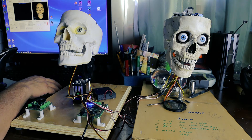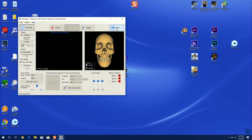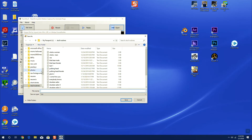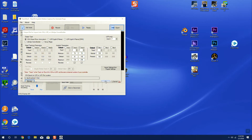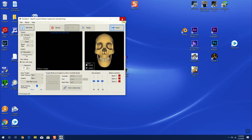We're going to go ahead and export it to a VSA setting. Now, if you look when we export, you'll see it says Output Type — this is different from what we said earlier. This is our setting to send it to VSA, and you'll notice my settings here are different: they're going to match what VSA has as its maximum and minimum settings. I'm going to go ahead and save this to skull routines and call it skull routine 1.2. It's telling me the export has been saved. To import, hit F7, and to check my settings hit F3 — that'll be really important in just a second.